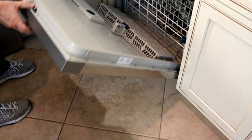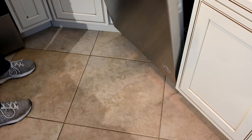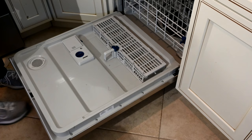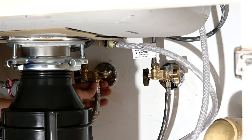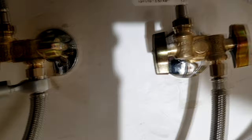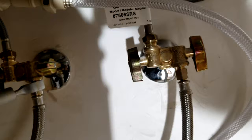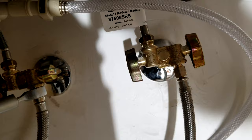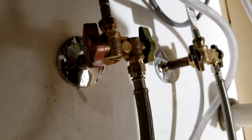To check the tensioning of the spring, make sure the door doesn't just drop out of your hand — it should be where you push it down and it stays down, and closing should be smooth. If it isn't, you'll have to play with the spring tensioning. But in my entire life I have not come across one brand-new dishwasher that needed any adjustment on the door springs — they set them at the factory and they're usually pretty good. Now I come in and tighten the water supply connection with the Ridgid one-stop wrench — about a half a turn past hand tight is all you need.